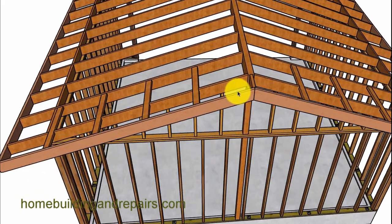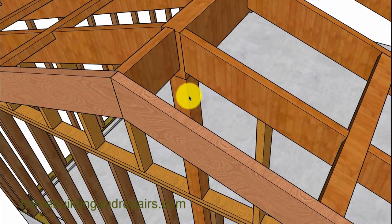Take another look at it here — post underneath, the ridge beam, and a block. Sometimes this is going to work out just fine depending upon the strength of the roof, how far the overhang is going to be. A 12-inch overhang with a block like this: if you have outlookers within two feet, that'd be fine.